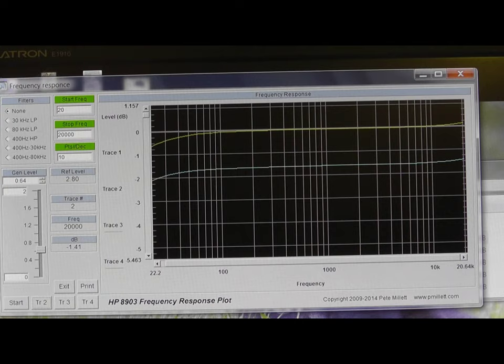That's basically down to the volume control on the Revox itself being turned quite low down. If I'd set the volume control to halfway and done that again, you'd probably find these levels are pretty even. It's not a problem with the gain in the amplifier. As I said, it's down to the volume pot itself. Really blown away with those frequency response charts.